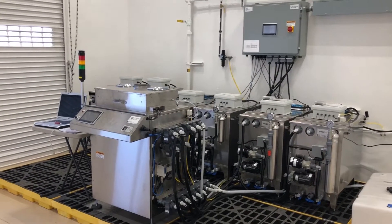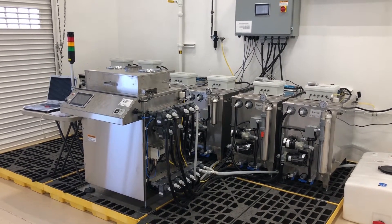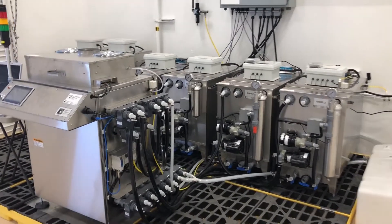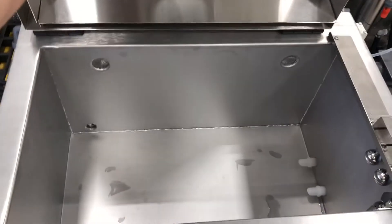The Best Technology fully automated nitric and citric passivation system features six storage tanks and one central processing unit, utilizing pumps and valves to push fluids back and forth between the central processing unit. The central processing unit itself also features an integrated dryer in the lid, to be able to wash, rinse, passivate, rinse, and dry your parts.